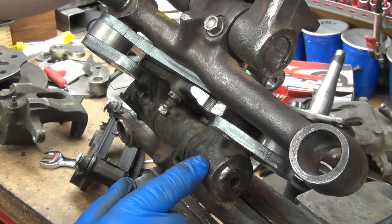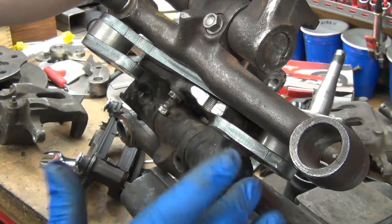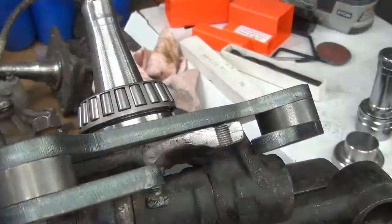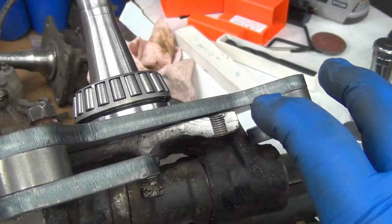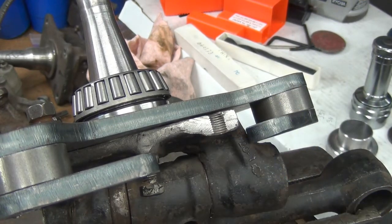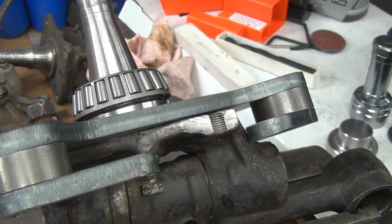But there's a step in here. I don't remember if the kingpin has a step in it. It could just be that this is a bigger, thicker bushing for strength. That kind of sucks. I tested and prepped everything for the 521, so I didn't account for that on the 620. And I made everything a little bit tighter tolerance-wise. So looks like I'm going to have to do a little grinding on that tab there to get that to fit the 620.